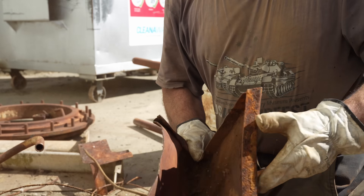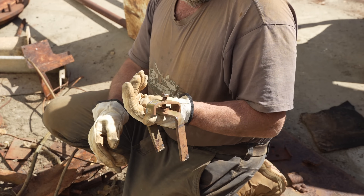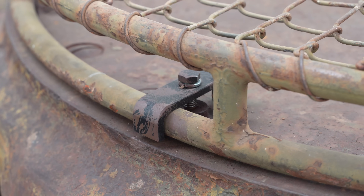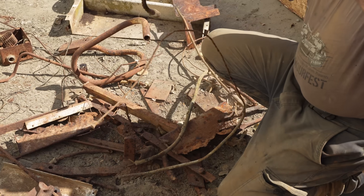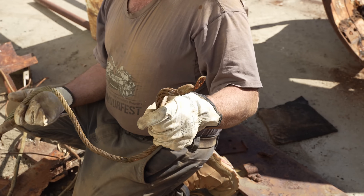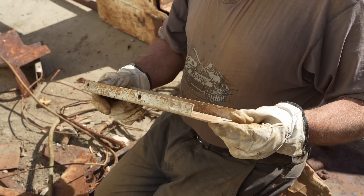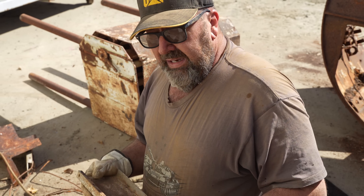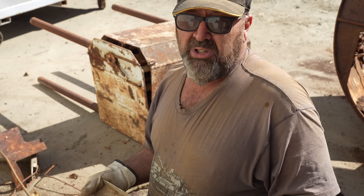This here — you might have recognised it from the Tina Rustoration — holds down the Australian wire mesh anti-grenade mesh. There's a periscope guard for the gunner to put his forehead against. That there looks like junk to anybody, but that's actually the earth cable for the 24-volt system. There's another internal bin bracket made of aluminium. They were using a lot of aluminium parts to try and keep the weight of the tank down.